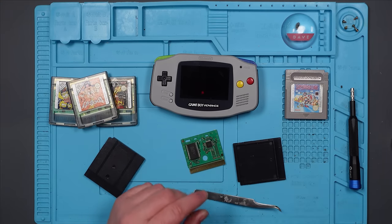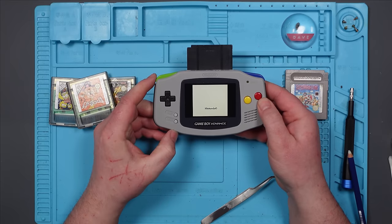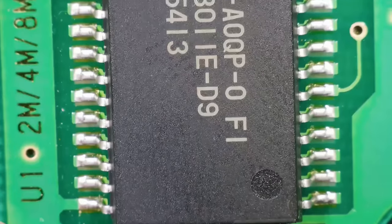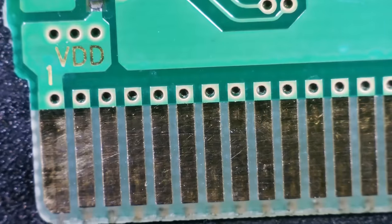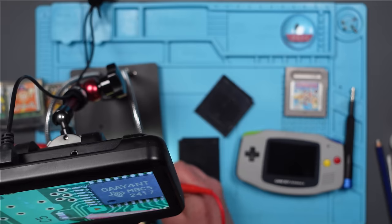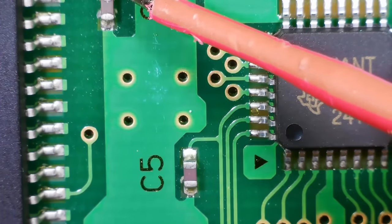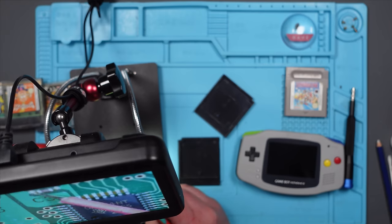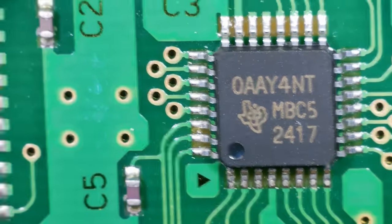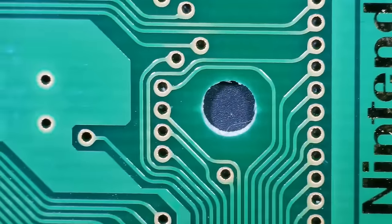No sellotape on this one. Promising. It did that before - Nintendo logo, but then blank. So none of them work after cleaning. Wow, I was not expecting that. All right, it's time to get the microscope out. Let's have a close look at these and see if we can see anything going on. I'll start with Toy Story 2. Nothing's jumping out at me. Let's see if we've got any shorts anywhere. Well, there's only a couple of grounds on this - there and there - and I think that's probably right, so I think that chip's okay. It looks in good condition. I wonder whether it just needs a reflow. Might just give these chips a bit of a reflow, but to be fair, they don't look bad.